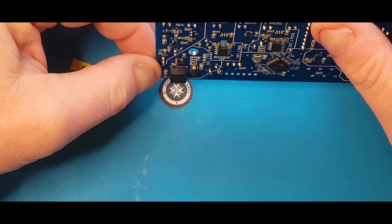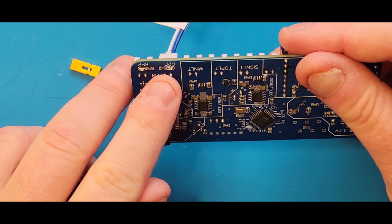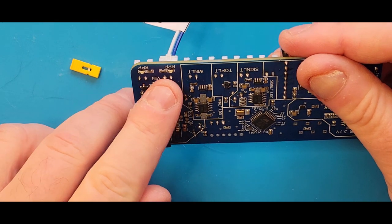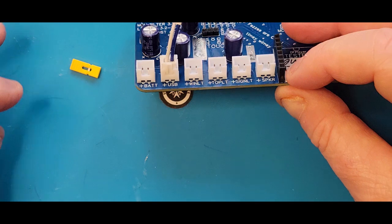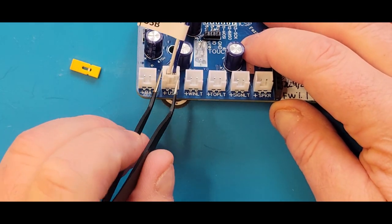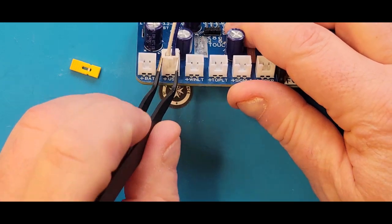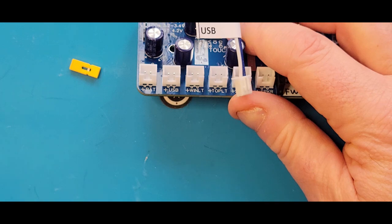And there it is. There should be 5 volts in there. And there is no LED on the bottom side. Here are the 2 LEDs. If they light red, disconnect power, disconnect the leads, the connector housing, and troubleshoot. And again, I'm going to disconnect power just to be thorough, and you can see I'm lifting with the tweezers at the shoulders of it, and there it comes off.